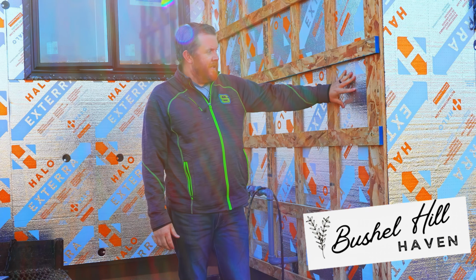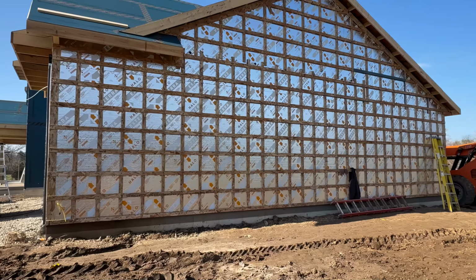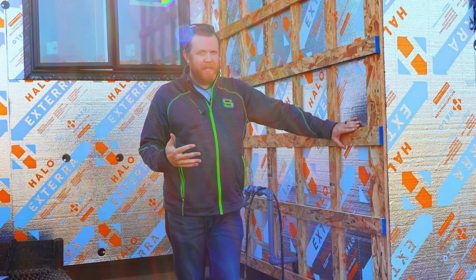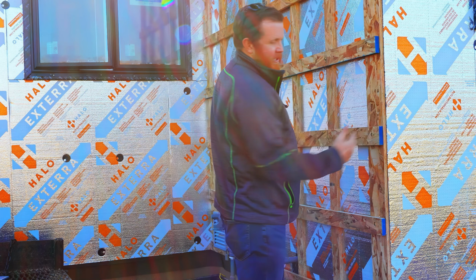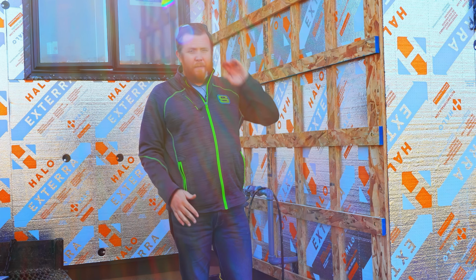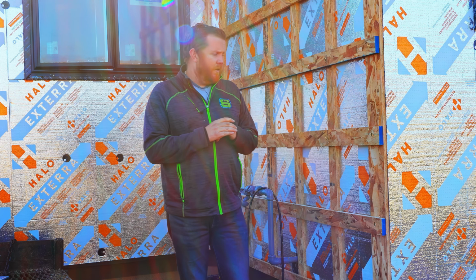We're finally on to putting our exterior blanket of insulation on, and then outside of that we are doing our rain screen detail. So there's plenty of ways to do a rain screen. On this one particular, I'm going to point out what we did. But first of all, obviously this exterior insulation is like, again, you're putting a blanket on the house. So we're stopping any of the thermal bridging that can happen between stud walls, stuff like that. You can find some of that where we talk about it in other videos.